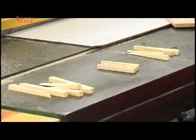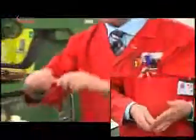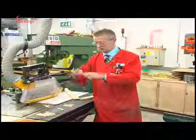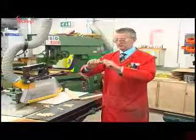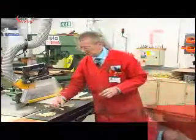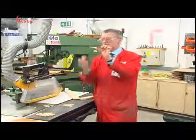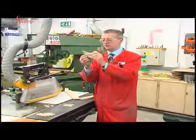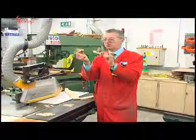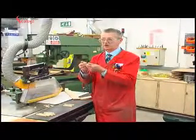The second one — well, okay, they look long, they look tapered, but structurally that's no good. These aren't very good at all. Whereas before, we can't break them. The reason being is the grain structure. The first ones we did are correct — you'll notice that the grain is running lengthwise. The second ones that we created, if you look at that very carefully, the grain structure is going vertically. So instead of cutting with the grain, we've now cut across the grain. Structurally, there's no integrity. They're very, very weak. So they're no good.